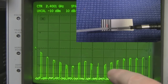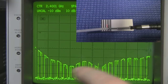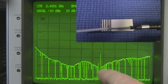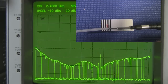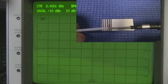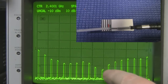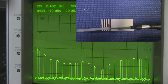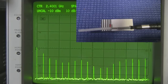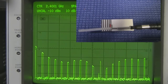The response is getting a little better but we're still getting an equal response on the other side at about 1.8 GHz, so both responses are interfering with each other. It would be an okay antenna but not a great one. Moving it back a little more, we're starting to get that nice V-shape frequency response we want, and the V-shape on the opposite side has all but disappeared. Moving that extra millimeter and a half and refreshing — now we're getting a really good frequency response right where we want it.